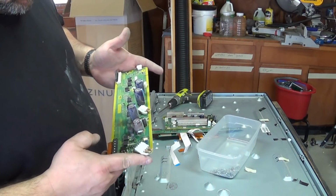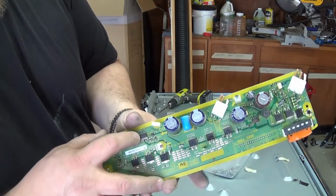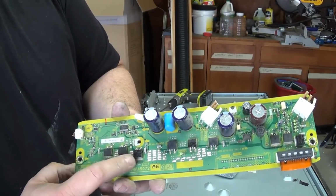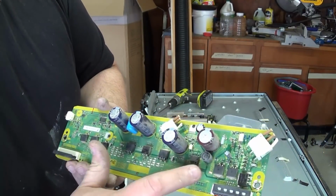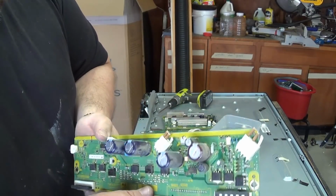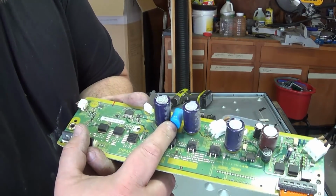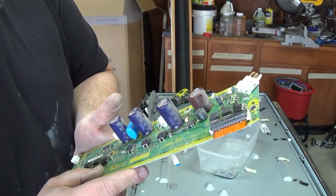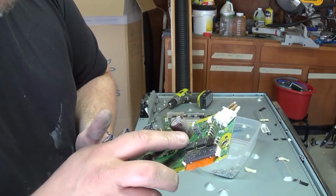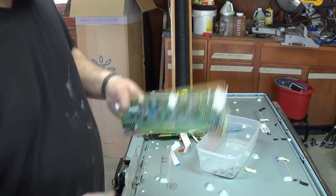All right, and looking at this guy. So the first thing that I'm going to point out is, okay, so number 1, we've got the IC chip. We have the MLCCs right there. These little guys, those can contain gold and can be processed just like IC chips. Oh, this guy right here, that capacitor may contain silver, so make sure you put that aside. And again, those tiny little SMDs that may or may not contain silver, ruthenium, palladium, platinum, and so on. Right, nothing on the other side, so again, another low grade board.